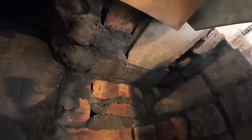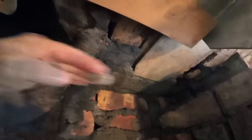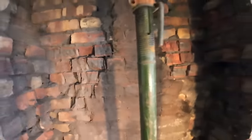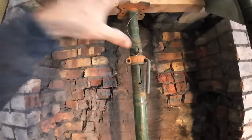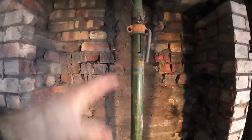The gathering in, it's not tumbling in, so that lintel's going to go in there. It's going to sit on that end, which is not going to hold anything. And this end is going to hold this. So basically, the lintel is replacing the corbels. So as you can see, it's not as straightforward as it looks when you're looking at it. There's a lot that goes on inside a chimney breast, especially at the fireplace area just here.